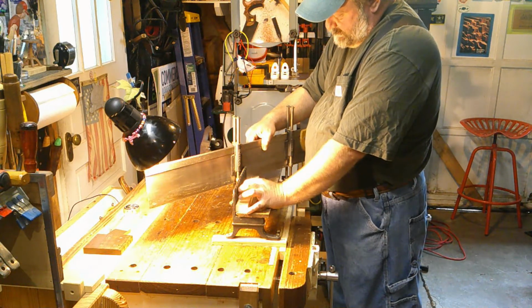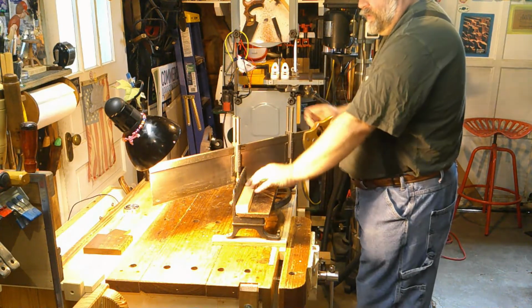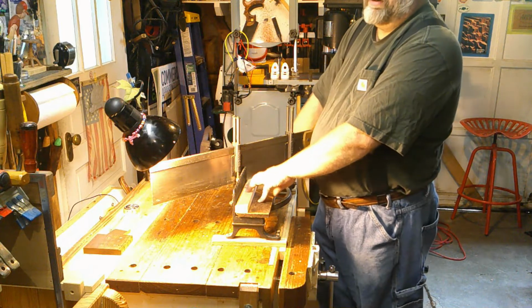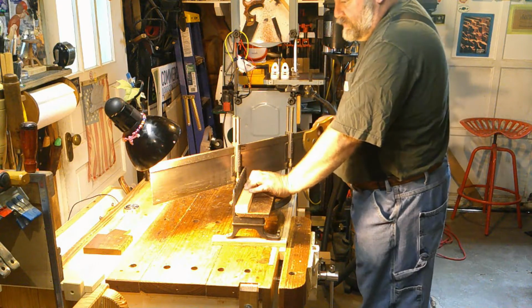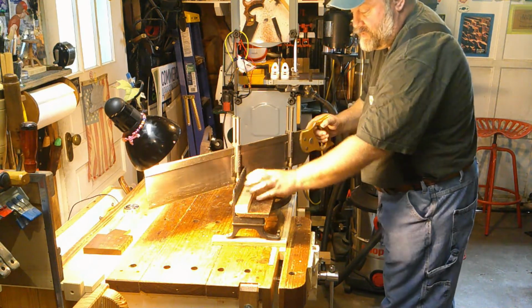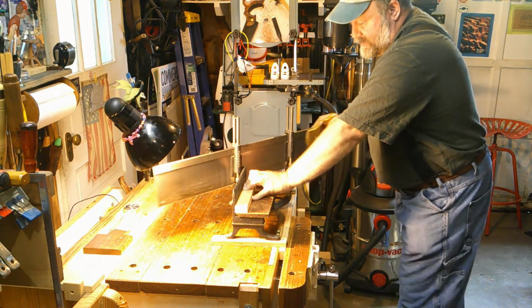Lift the saw right on there about the middle of the saw. We're going to cut a little large on this, away from the line. So if it sticks out of our joint some, that's fine. We can plane that down. It's probably better to have a little large than spot on to the thickness of the piece of wood, and I'll show you what I mean by that in a little bit. So we pull back on this to score the cut. Push it forward. You can clamp this to the thing, but after that saw starts to curve, it should ride within there okay. Take it kind of slow first.